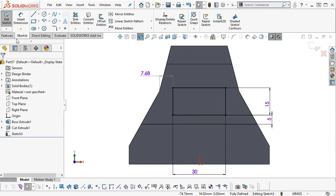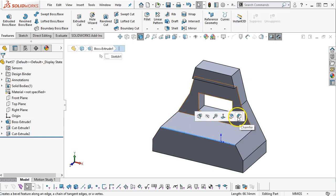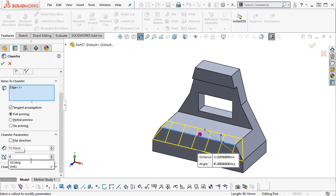All right, so question: do I go with the fillets? Well, it's probably going to break the symmetry. So going ahead and cutting it through is a better choice. So let's try the chamfer here. We have a length and an angle. So 10 and 22 would be 12. Well, 22 minus 10 would leave me 12. 30-degree angle.